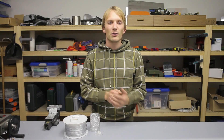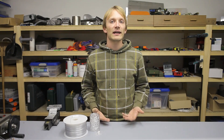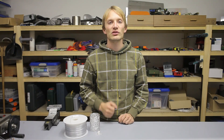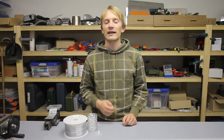This might all sound like polycarbonate is something that you wouldn't really want to use. And it's true — it's not ever going to replace ABS or PLA as a daily driver filament. But just like nylon, it's a material that is well-suited for specialty applications, especially for those where nylon is too soft. I'll be using it for 1/10th scale RC car spares. Because of its neat optical properties, polycarbonate is also well-suited for glowy things, but PET filaments like Colorfabb XT or Taulman T-Glaze are probably the better choice for those things, since PET is actually printable.